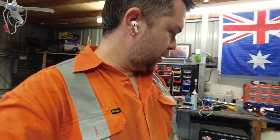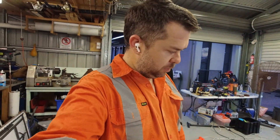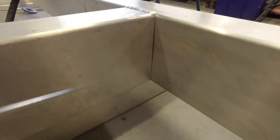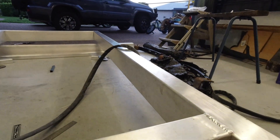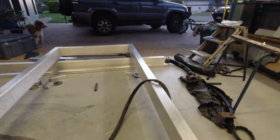That's the top and bottom of the chassis welded. Fairly happy with the welds. Now I need to start flipping this thing up on its sides and welding. I'm going to spread the welds out so I don't warp it, then weld the seams on the ends as well — and that's the chassis frame done.